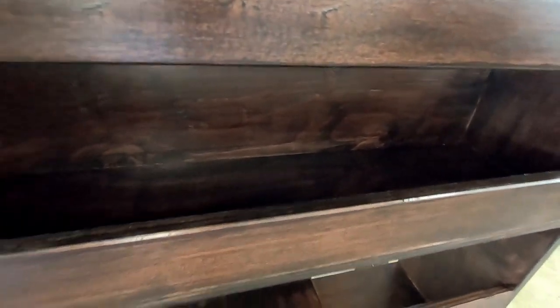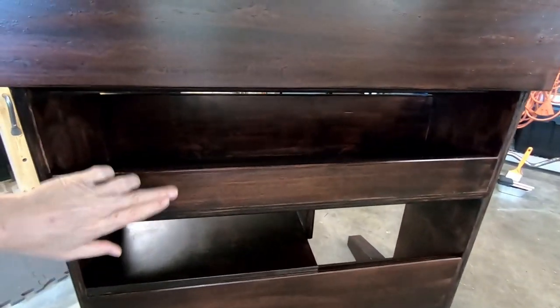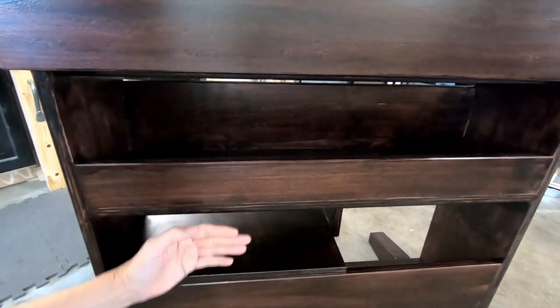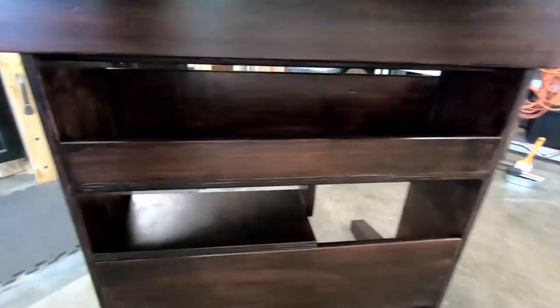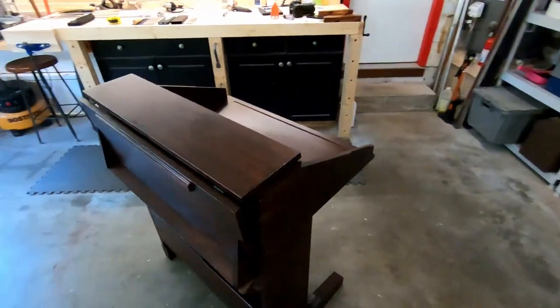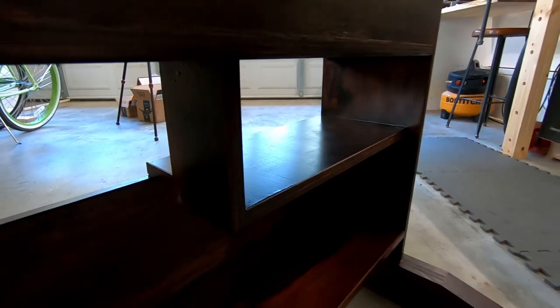See, this is the shelf I built back here. It's more of a container, all the cabling. I can wind it up and drop it down in there. Whereas in your design, you may want to just make this piece taller. Take this length here plus this length, and you can make a taller back shelf here. You can adjust that as you need to. You don't feel constrained to do it the same way I did. You just want to make sure you maximize the usage of your sheet of plywood. There's that extra shelf we dropped in there at the last minute.